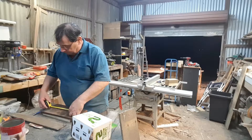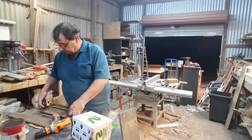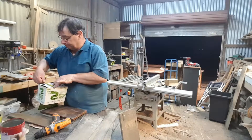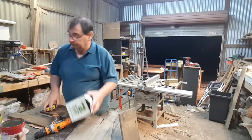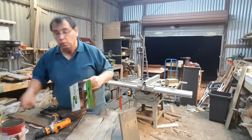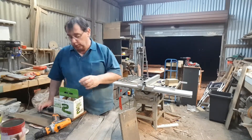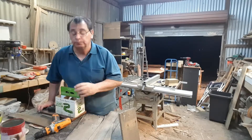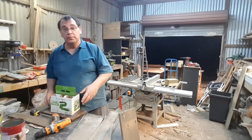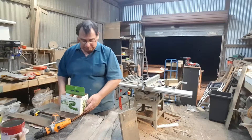Let's go an even 250 - which is approximately 9¾ inches. That one is 125, which is 4½ inches. Close enough. And this one here is going to be 187. Why these are a little bit out and different is because I'm going to use the box as my template. Main reason being is because if we're going to use other bottles, they might be slightly bigger. So therefore, we've got about a mil to play with, so the bottles can be slightly bigger. There's a little tip there for you. I've worked on quite a few of these and I've stuffed a few up, so trust me on that.